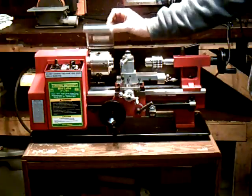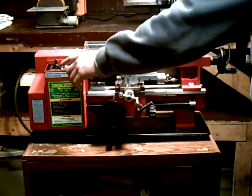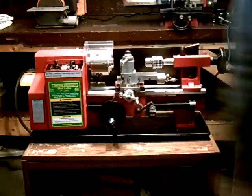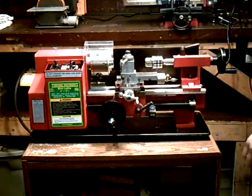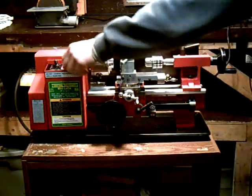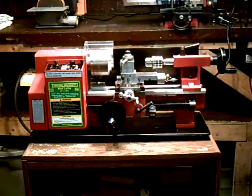To turn the machine on, your protective cover's got to be down. You've got your main power switch — put it in the on position and then put it in forward. The machine's got two gears, high and low. Low gear goes from 0 to 1,100 RPM. I do most of my stuff in low gear. Turn it on about halfway and it's going to be about 600 RPMs. You can hear it — it's not that loud, pretty quiet machine.